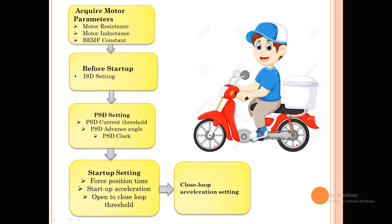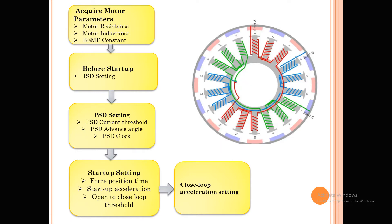Let's look at a ceiling fan motor design — this is a picture of a BLDC ceiling fan motor. The combination is 16 poles and 18 slots. As you can see, it has three phases, and all three phases are wound in such a way that they generate alternating N and S poles. The sequence in each winding is always N-S-N alternating.